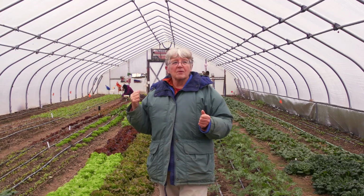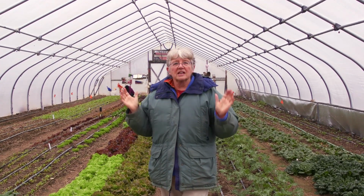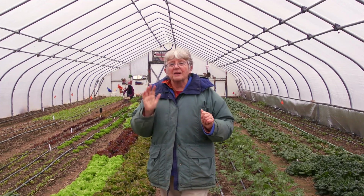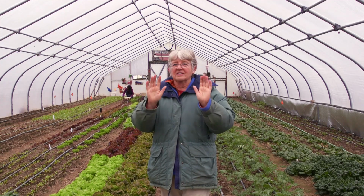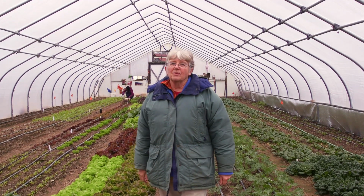We had a bit of trouble. We added in some diagonal bracing at the west end because that's the direction the strongest winds come from. And we noticed when we changed the plastic that the whole thing was starting to lean a bit to the east. So we've beefed up the west end a bit.